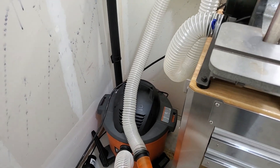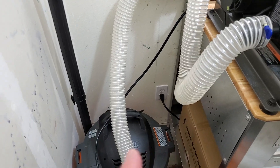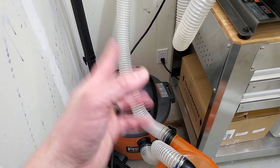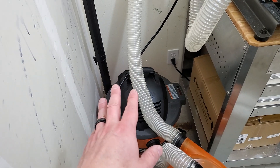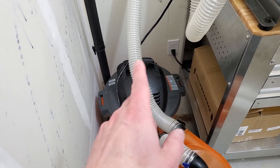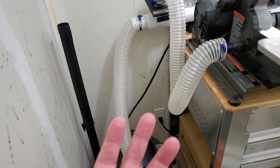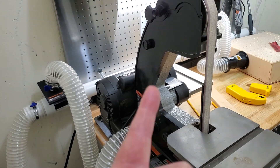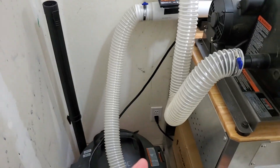So I said, well, I better check. I'm running this off of an outlet, and I assume I've got 15 amps for this room because that's your standard household outlet. That 164 CFM unit draws 12.2 amps — a little over 12 amps on a 15 amp circuit. But I also got to run the sander, and the sander is supposed to draw six amps according to the label. So that's 18 amps on a 15 amp circuit — shouldn't work.